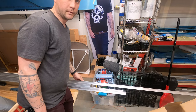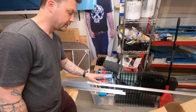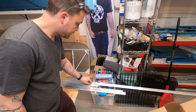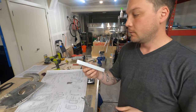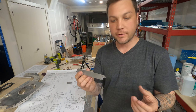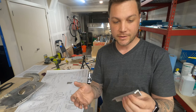Well, these are trimmed — they were a lot of work. It didn't help that my bandsaw got sort of a mean shimmy to it partway through and made that cut a lot harder to control. But they're nice and straight, cleaned up with the file — they look gorgeous. I'm going to get them drilled to the bulkheads. After those are completed, we went ahead and made yet another angled bracket that goes to the top, again acting as sort of a shelf, much like 710's bracket except this one's a little bit smaller. These long runs — you definitely don't want to cut those; these are 12-footers. Now they should be 0.063, but they're not — they're 0.125. I could use those, but Vans might want them back. I just sent an email.